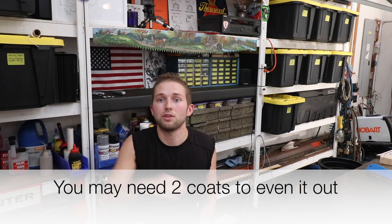For people concerned about the color difference between the new stuff and the old stuff — if you want to match the color, all you have to do is get the old stuff wet and paint some Portland mixed up with water into a paint, and brush it right on there. You can even go over the new stuff. In the front section of the house, after I finished parging, I got it wet and brushed on some Portland paint just to get a unified color over the job. I didn't do that down the whole section of the house, but if you're that OCD about it, you could absolutely do that. All you do is take the Portland and paint it on and you can make everything match.